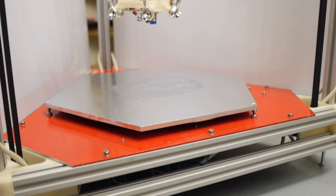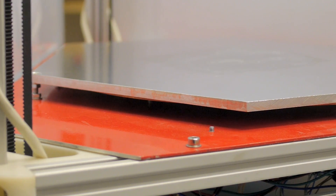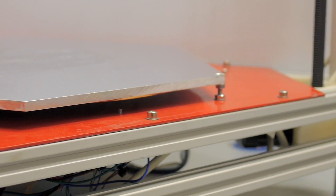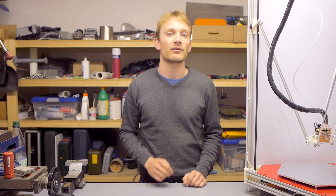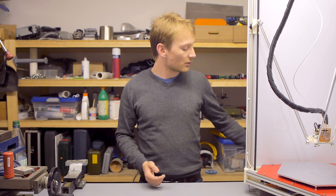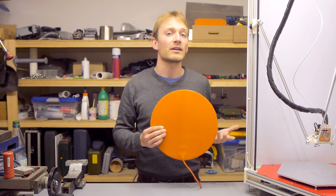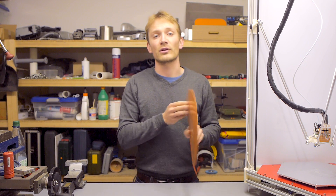Like for my pet project, the Cerberus Reborn printer, which has a pretty massive hexagon-shaped print bed with an outer diameter of 350mm. And since I hate waiting, I decided that it needed an equally massive heater. So in my case, I ordered a 650W silicone heater, but now that I think about it, I should have gone with the full kilowatt.